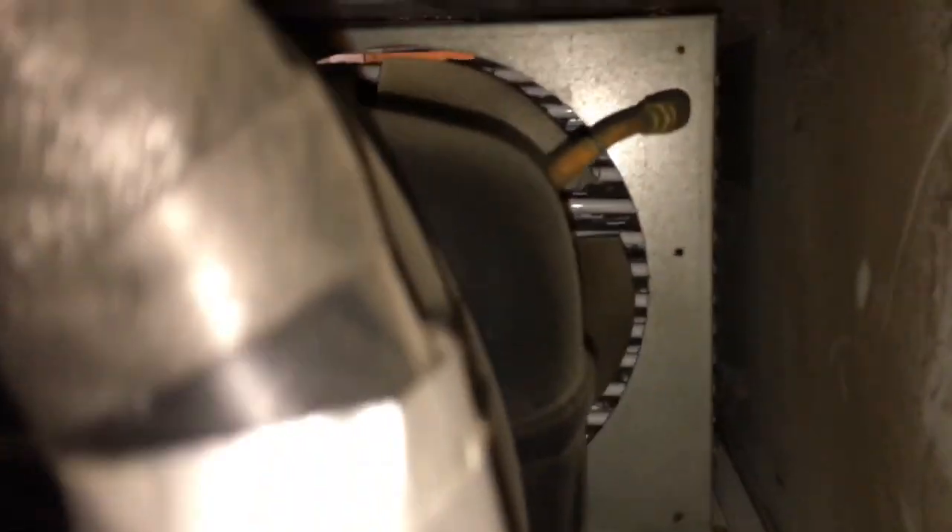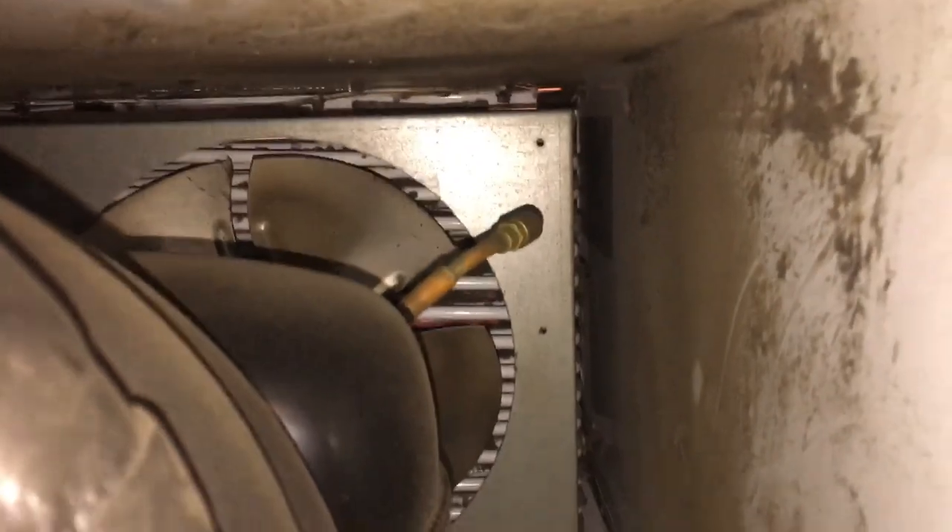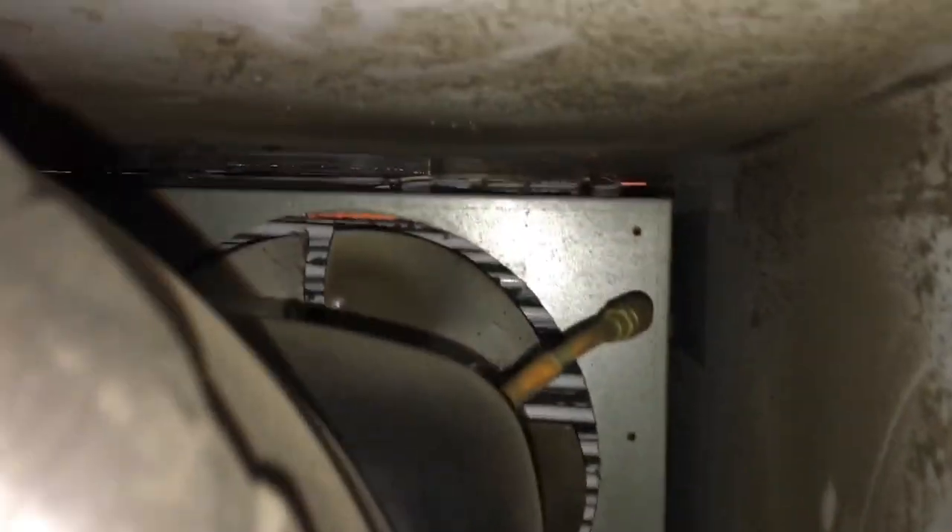The condenser's pretty dirty, I don't like the look of that. Visual inspection of the back side - sniff test, no burned smell, I don't think. I don't see anything obvious right now.